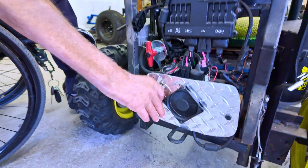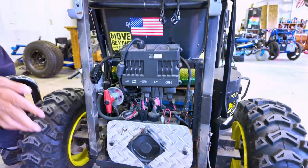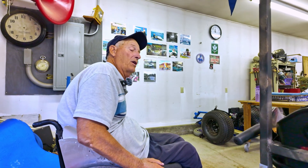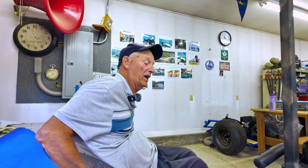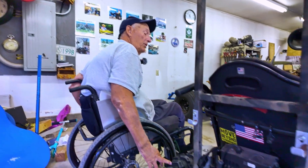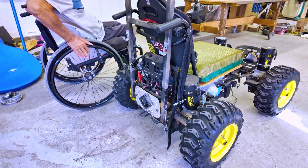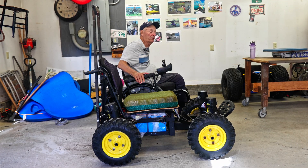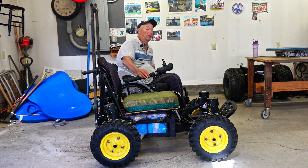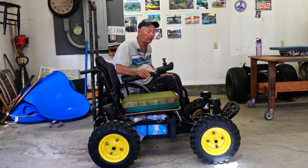I did put a little fan on this to cool the back controller. The back wheels on this machine do a lot more work than the front because they're carrying more weight. Going up steep hills, more and more weight is on the back wheels, so you end up generating a fair amount more heat in that back controller. You just want to keep it as cool as possible — keep it from going into limp mode. This machine doesn't seem to have that problem; it handles most everything very well.